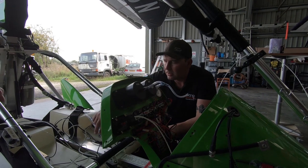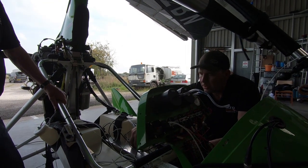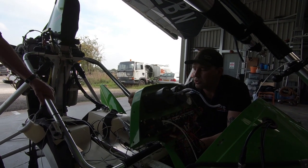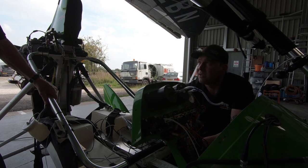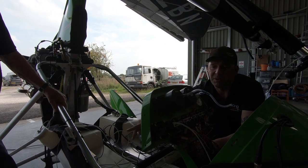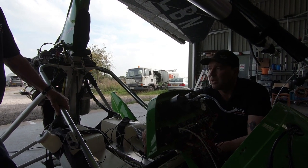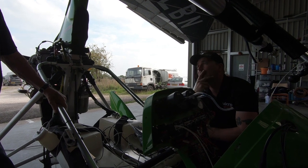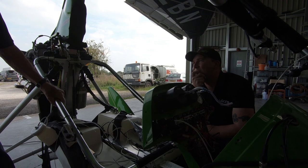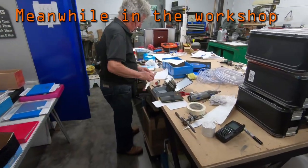Do I connect everything up, because I've got to put this in for the Pilot Aware. Do I run the power off that as well, so that the radio, transponder and Pilot Aware are on the same fuse? Or do I put the transponder on the radio and connect the Pilot Aware up to the other one, so I'm splitting fuses? That's what I would do. Yeah, that kind of was my initial thought. And then we're separated.